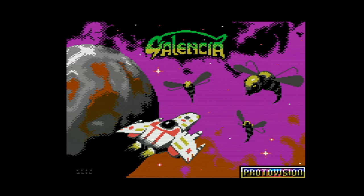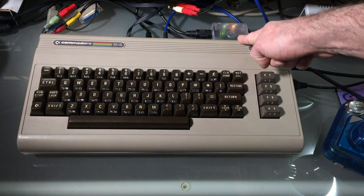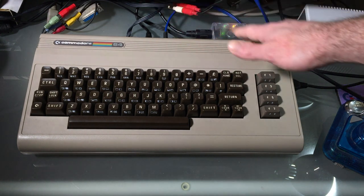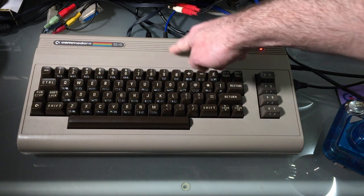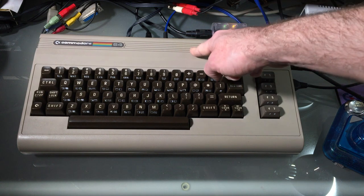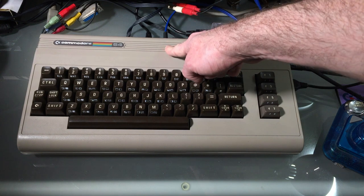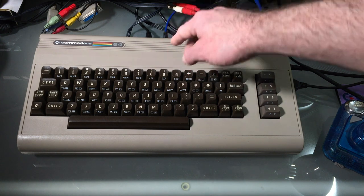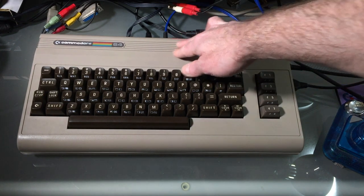One particular thing I found in my setup is that with using the Ultimate 1541 Ultimate 2 Plus that I have here, I get a slight hiss noise through the audio out. The audio also comes through the AV socket as usual. You don't have audio out on the component mod itself, obviously, because that only has the video out. Audio comes through the old AV jack. So you will have to either make a cable or use an old cable and only use audio from that to have audio output.